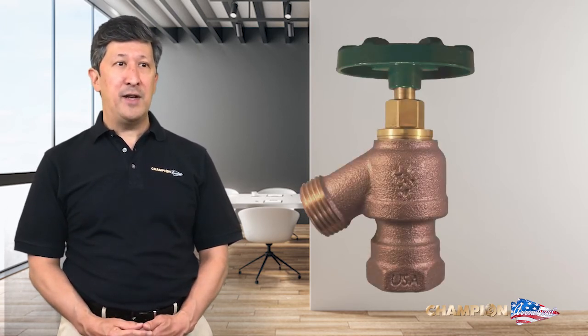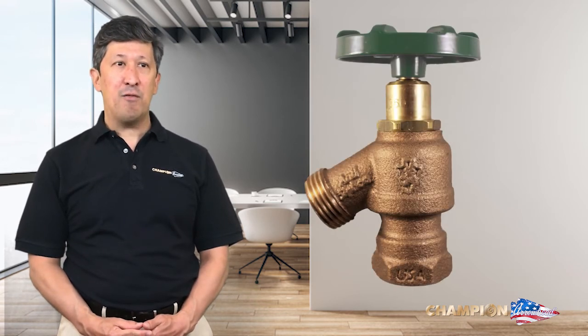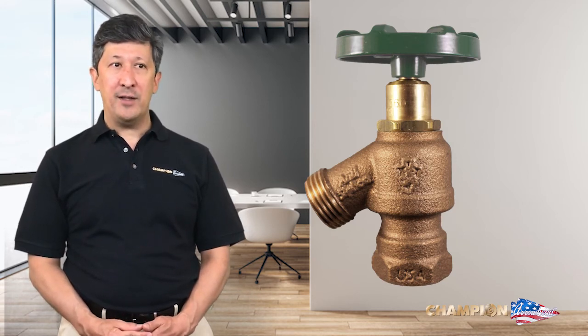Arrowhead Brass garden valves are another type of hose bib that's been around for many years. The difference between a hose bib and a garden valve is the water supply inlet direction — for garden valves, the inlet is vertical with either a bent nose outlet or an inverted nose. Garden valves are available with ¾-inch hose thread outlets and either 1-inch female pipe thread inlet or nested ½-inch and ¾-inch threads like on the 925LF and 927LF. We also offer the 965LF that combines the nested thread garden valve with the Arrow Breaker integrated backflow preventer technology.